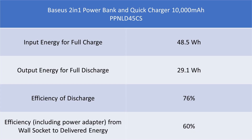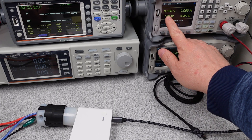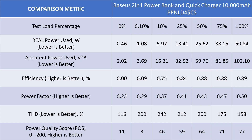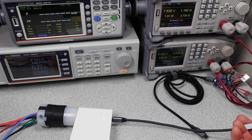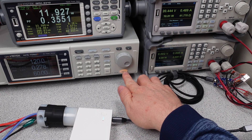Here is the data for the Baseus as a power bank. The overall efficiency end-to-end is low. It charges fairly slowly — way slower than 45 watts. The battery can deliver about 29 watt hours to your device, which means it isn't charging your laptop or tablet, but should be able to get a full charge into a phone. The power did drop to only 20 watts and the voltage dropped to 15 volts, which will trigger issues if you try to use this with a laptop. This device does not function as an uninterruptible power supply — on power off of the AC side, the DC side goes to zero. As a power adapter, this is a bad one — among the worst I have ever seen. The idle power usage is high, the efficiency is low, and both are low enough that it doubly doesn't meet the claimed Department of Energy standards. This is likely a straight-up lie on the product, or some tricks were done — like the battery was removed for testing. I guess in that case it's still a lie. The device will also turn off if the load is light enough, so this may struggle to charge smartwatches or headphones.